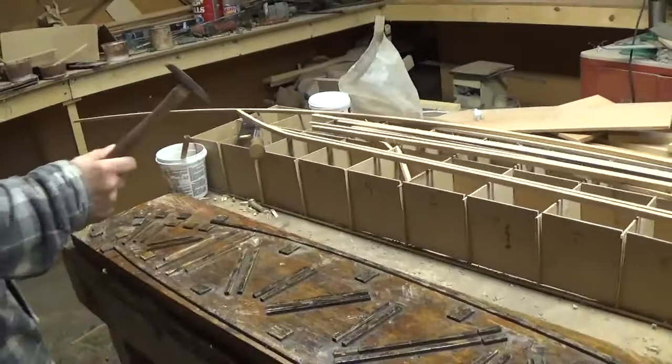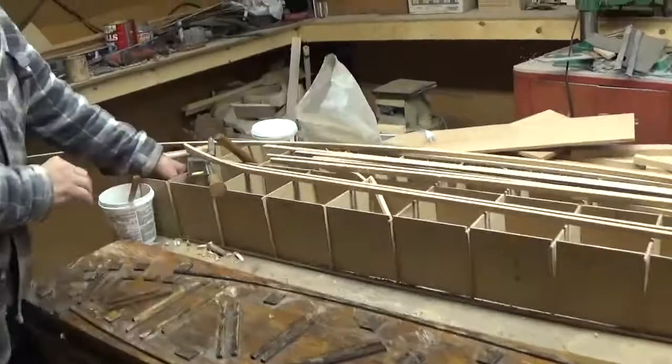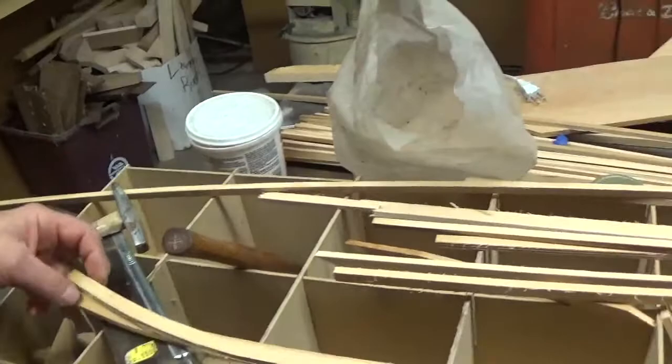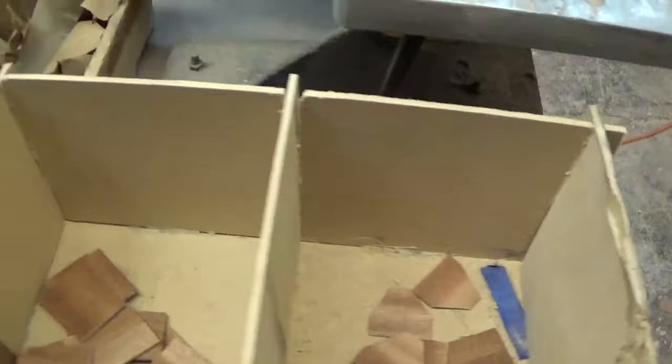First of all, I've pre-cut the plywood gussets. I've pre-cut the sticks to the right width to fit in the jig. I've pre-bent them in a tool that I made. And here's all the gussets. Don't have to build this thing that holds all of these. Little plastic dishes work just fine.